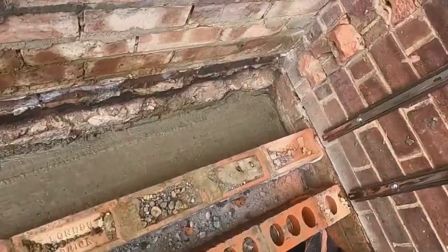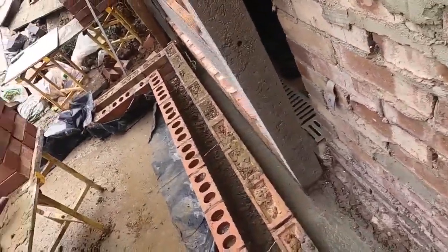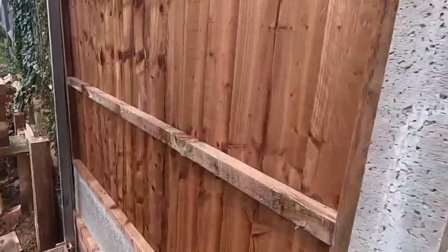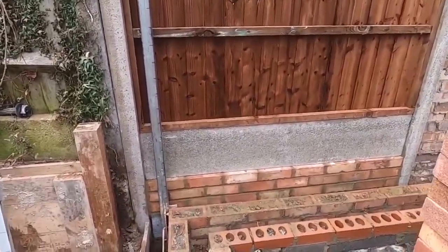Melvin's got the flu, so he's just going to get the fence panel and gravel board to go in there. What we did down here — got 75mm fall from there to there, put this little bit of brickwork up. They wanted the face side facing out — they got it. Flettons, I know, not the best, but that's what they wanted. Gravel board and the fence panel back in. That's the party wall agreement satisfied.